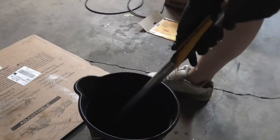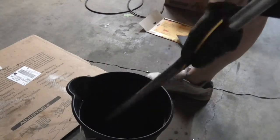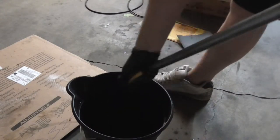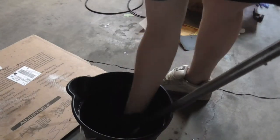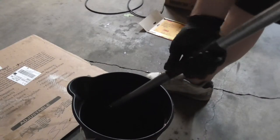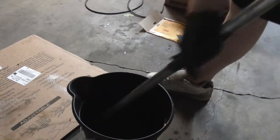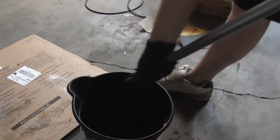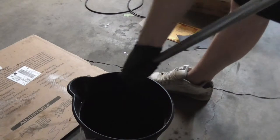I'm just going to dip it down in there to get all that stuff off of it. Already there's a lot of stuff coming off. Getting all those lines out from sanding with the rotary, which isn't the best way to do it — it's not the right way, but it's the only way I've got available. The blue and rust remover did a pretty good job, but it just wasn't taking to the barrel very much because of the bluing, whatever kind of bluing that is — it really just sucks to take off. So this isn't going to be as clean as I want it to be — we'll just have to get as close as we can.